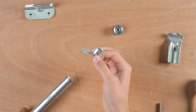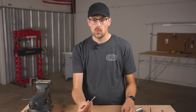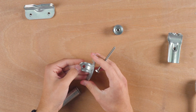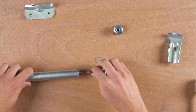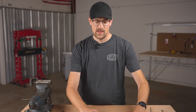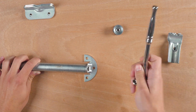Basically all you're going to do is take one of the flange base pieces and get a quarter-twenty bolt, because the hole in the connector pieces accepts a quarter-twenty size. You just put the quarter-twenty bolt through and then thread it into the lipped insert. I probably should have got a shorter bolt for the video, but I'll just thread it in here.